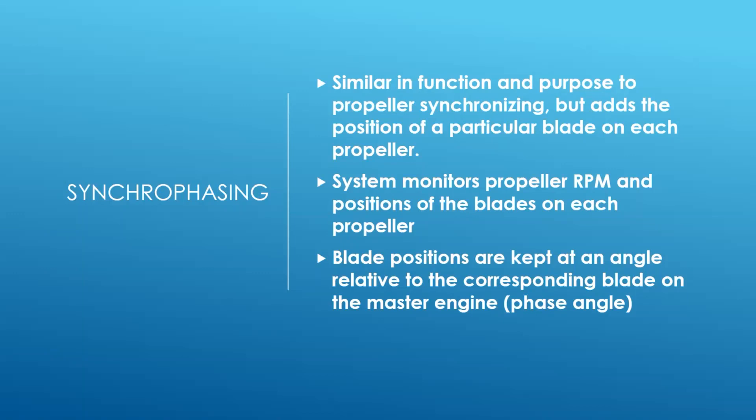You turn the system on and verify it engages. From the cockpit you can see if RPMs are equal and if synchronization is working. Verifying phasing is more complex - partly sound-based since you can hear different vibration if they're not phasing, but there are also vibration analyzers and systems that use a reflector on one of the blades with a laser shot at it to know when the blade is at a certain position. The main company making that test equipment is Viper - you'll see the Viper 2 boxes, though newer equipment may be replacing those.